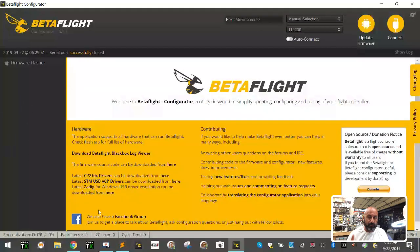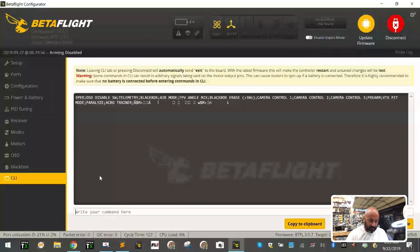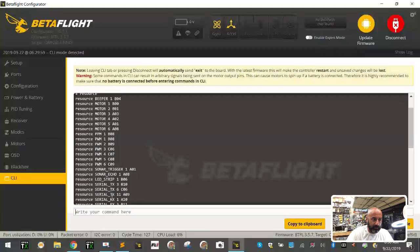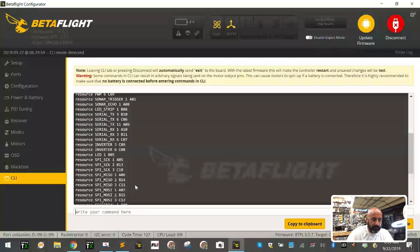Okay, now, just to show you a difference between what we saw in the CLI and what we see now, just go back and connect, go to CLI and type resource. Now, what you're gonna see is, where it used to say serial one, serial TX1, it's now gonna say serial TX11, okay? So now all your hardware serial TX ports are here, and then after that comes your software, and then now your hardware RX. And we don't need to change any hardware RX because we're using the SBUS, which is great for us, okay? So we're just gonna leave it like that.